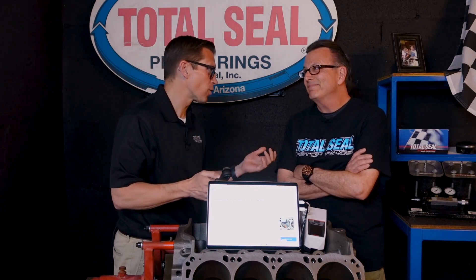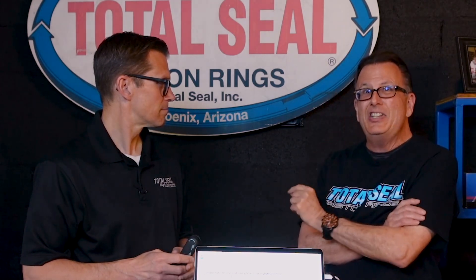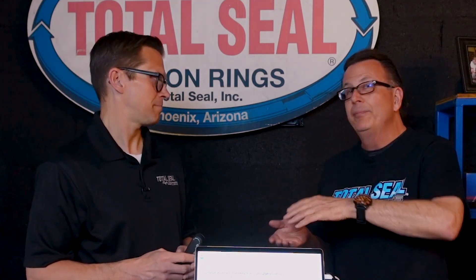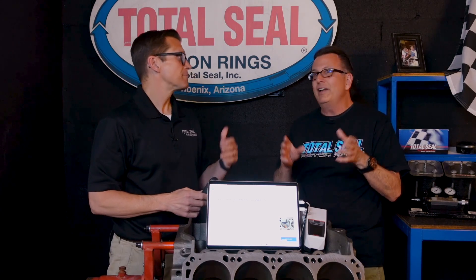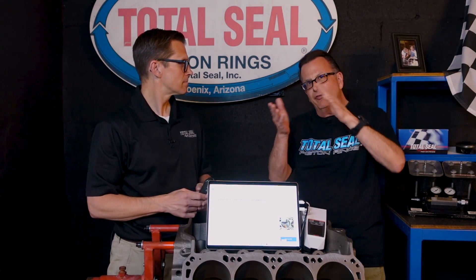You can't feel torn and folded with your fingernail. I had a customer you were both familiar with. He had some good numbers, but he kept having micro welding problems — could not understand where the micro welding problem came from. As Lake just said, he had folded the metal over. The numbers were good, but as the engine was breaking in and running on the dyno, all those little folded-over pieces were coming loose, getting in the ring land and the skirt — creating his micro welding problem simply because it folded or rolled the metal over instead of cutting it off cleanly.